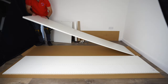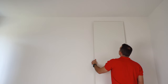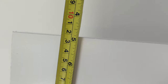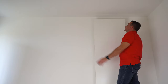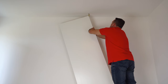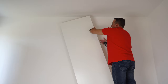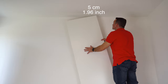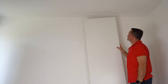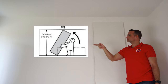We have a 236.5 cm IKEA PAX wardrobe frame, and in our case we have 12.2 cm of space between the ceiling and the top of the wardrobe. That's a good amount of space to build the wardrobe on the floor as we're doing here. If your ceiling clearance is less than 8 cm, you're going to have to build it upright — make sure you measure your ceiling before you buy. If the clearance is less than 8 cm, you'll need to build it upright; there's a video for that and I'll leave the link in the description.